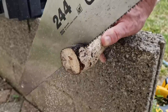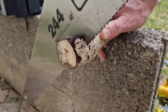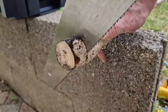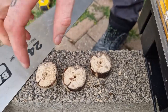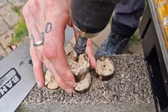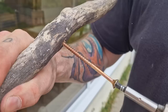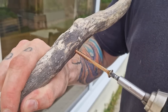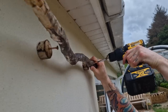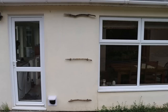To create a spacer for that three-quarter inch gap between the wall and the trellis, we cut driftwood into three-quarter inch discs and Josh drilled pilot holes through them so that they wouldn't split later on. He also drilled pilot holes through the driftwood rungs so they wouldn't split either. A long three-inch screw then went through the driftwood, the spacer and into the holes in the wall. In the end there were three sturdy rungs attached to the wall.